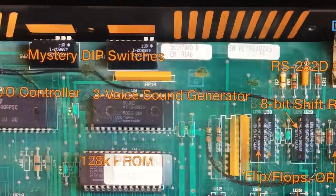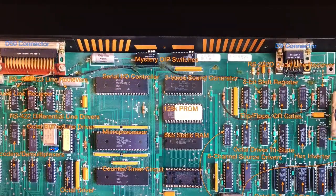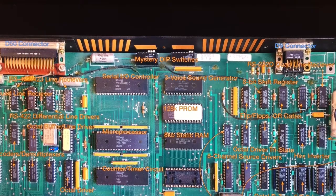Another question: this is a lot of electronics on this PCB — what's powering it? Where does it get its power from? I don't see any obvious power input. There's no VCC labeled anywhere. There is a ground, which is going to be part of the protocol, but there's no power in to power any of this. So how is that happening?